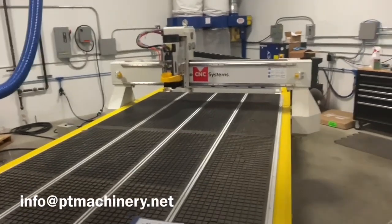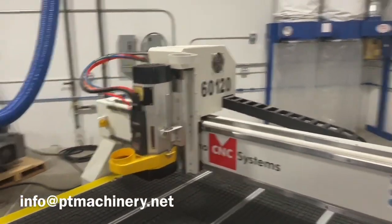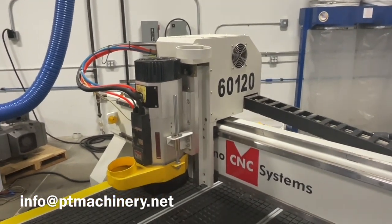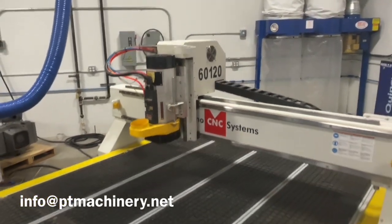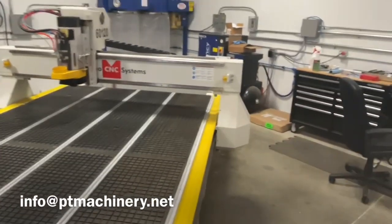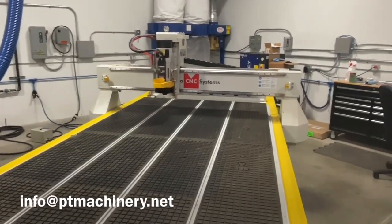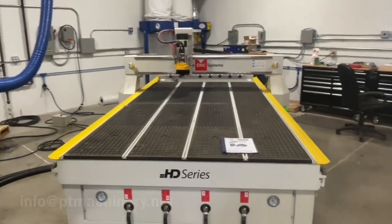The spindle is one of the most expensive parts on the machine - probably somewhere between ten and fifteen thousand dollars when new, and probably four to six thousand dollars to do a full bearing replacement. So we really don't want to buy a machine that might need a new spindle. Always make sure you can listen to the spindle, test it, and confirm that it sounds smooth and doesn't have a lot of vibration when you inspect it. We'll go ahead and get a tool in there now and come back to warm the spindle up.